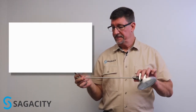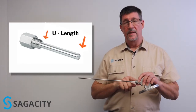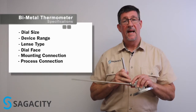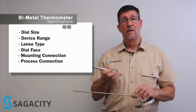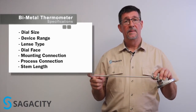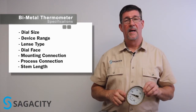This stem length needs to match your thermal well — this is called the U length. Where the process connection threads into your thermal well, the most common type is half-inch NPT, but there are other mounting styles and you'll need to make sure whatever connection you have on your thermometer is also going to be matched on your thermal well. There's a U length for your well that has to be matched to the U length of your thermometer. Once we have our stem length and we know how far our insertion depth is, we can finish specifying our bi-metal thermometer.